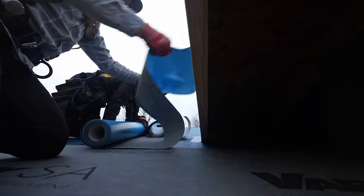Now that we got those two runs on, we need to get our valley because we're going to want to run over this sheet — so everything that goes into the valley will come down and be on top of this. Let's do it. Why aren't we putting the plastic right back in here — after we do it we'll just shove it right in there. Should we snap a line for this? We can snap a line or set it evenly in the valley. We'll do it your way this time.